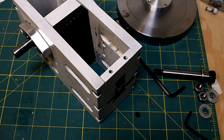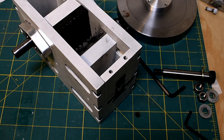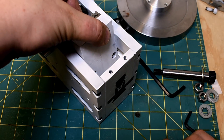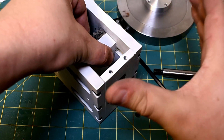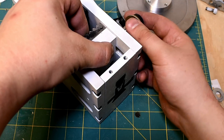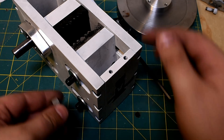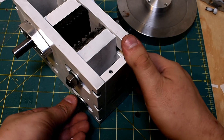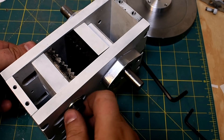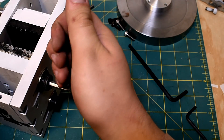We've got both sides on now. I'm going to take the fixed jaw and put it in here. The tolerances aren't typically critical on something like this — I just wanted to make sure this side wasn't too far off from the width of the fixed jaw support, so I can squeeze in and pinch the jaw to hold it in place rather than relying on friction from the underside of the washer. These are shoulder bolts — I'll push those through. This was designed to offer some adjustment for crush size, with plain nuts on the end. If I were to do this again, I'd just use plain half-inch thirteen bolts; shoulder screws were probably excessive.